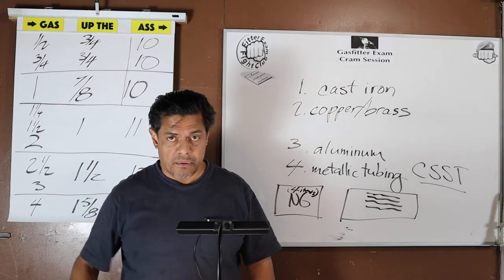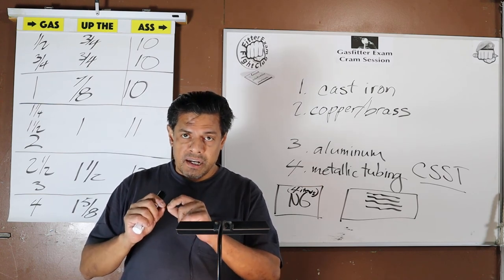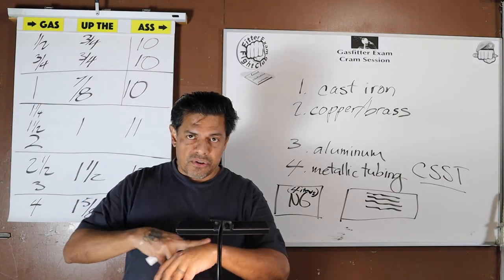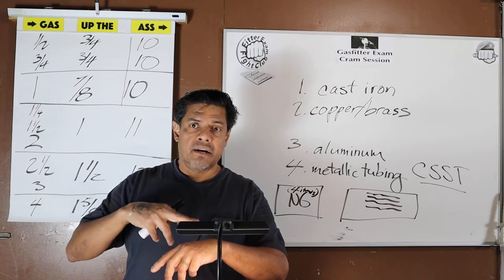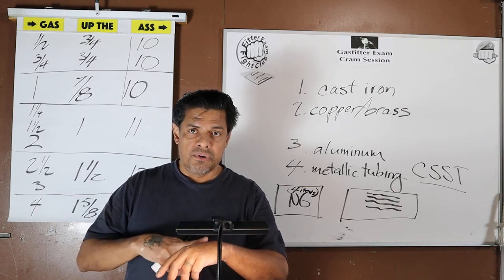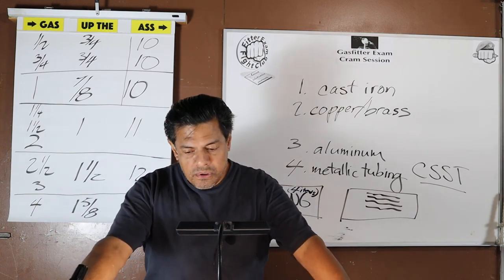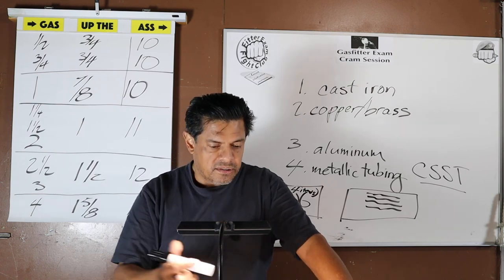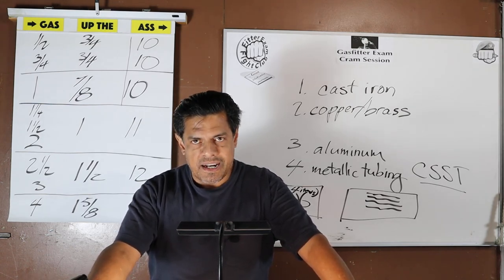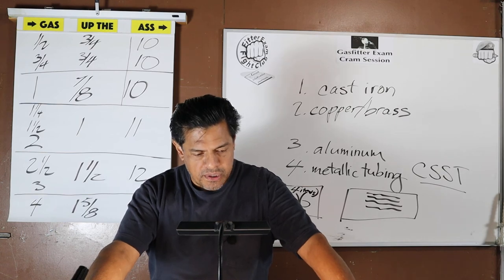Blowing all the stuff off our body is a problem because it's possible that little tiny fragments, little bits of metal, the pressure from the nozzle is going to shoot deep under your skin. You won't even notice it, but it'll be in there and slowly get infected and cause issues, and by the time you notice it, it's big. So no compressed air. We blow out the chip and scale at a pressure no higher than 30 psi, and we never clean ourselves off with compressed air. Not on a test, but I figured it doesn't hurt. Not safety first, it's safety always.